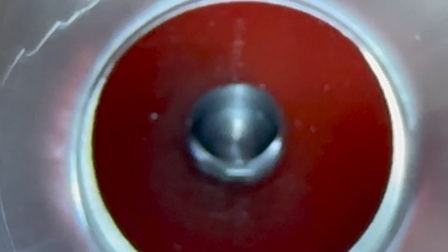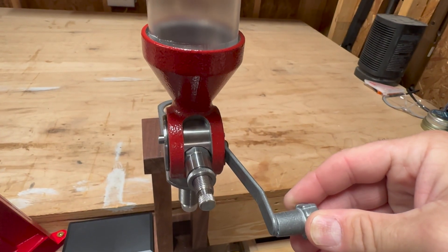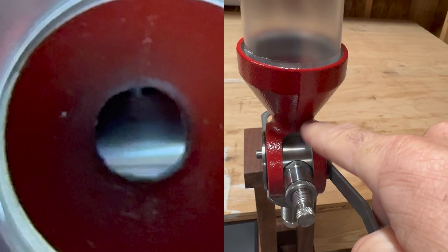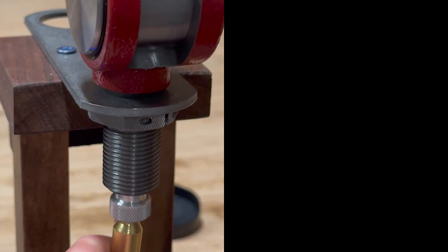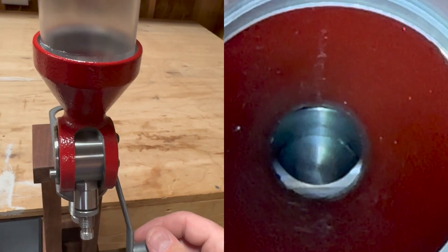Here's a closeup of the inside of the powder reservoir, looking straight down through the top of the tube. At the bottom you can see a little opening — that's the metering chamber volume. When I raise the handle up, you can see it start to rotate, and at the full raise, the powder is discharged. When I lower the handle back down, the chamber has dumped the powder and is now ready to receive the next load. Right here is about the crunch point where you have to put a little force into it, as any powder caught between the internal reservoir and the main area gets crunched as the cylinder rotates. I like to bump it a few times to make sure all the powder is discharged, then drop it back down and you're ready.